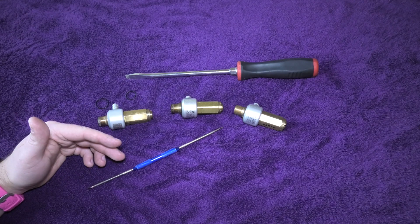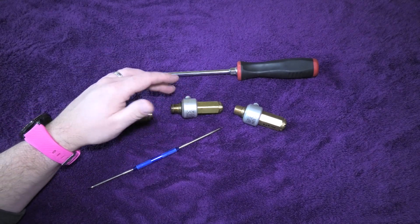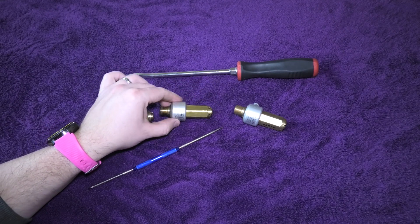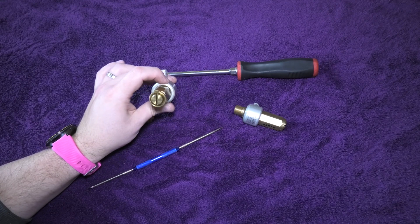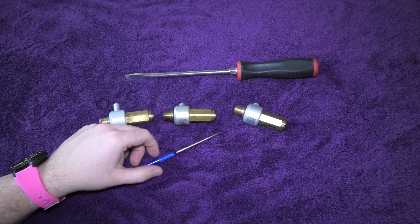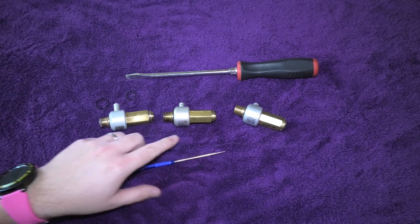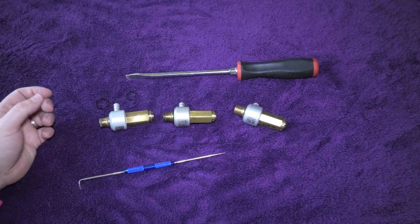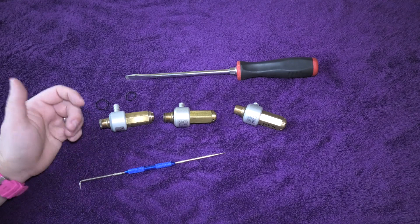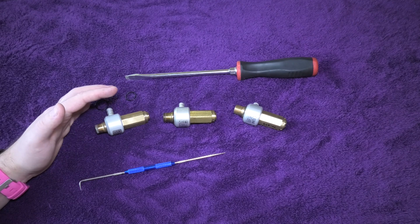You can adjust them — if you back these out, the threshold of pressure before it releases will be a lot lower. These are 280 bar relief valves, so if you've got a 250 bar washer, you'll probably find this is wound pretty much all the way in, so that once it hits its max of 280 bar — or you can set it at 270, 260, whatever threshold you want — you can adjust that. But you would need some form of pressure gauge on your pump to be able to set this and set the unloader.